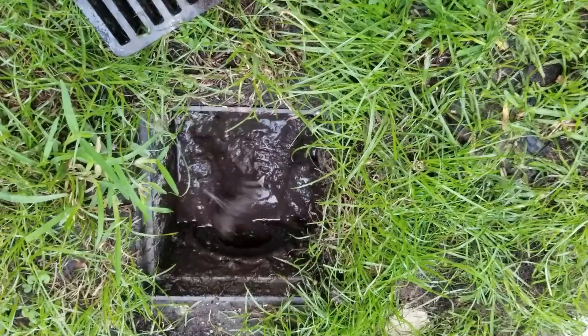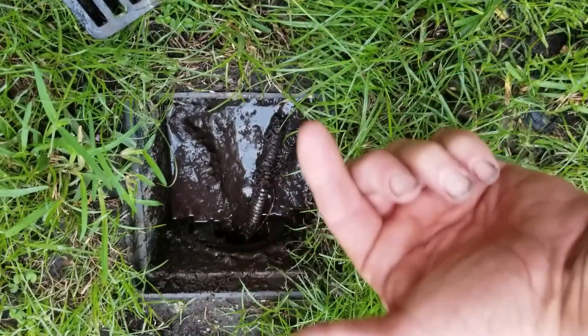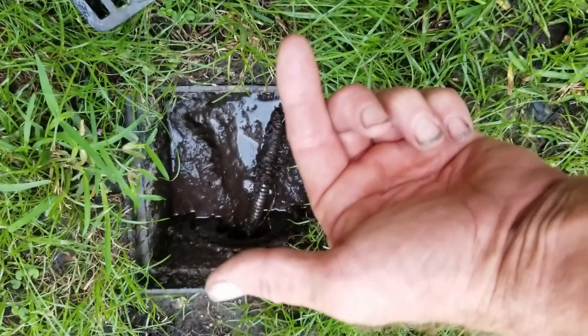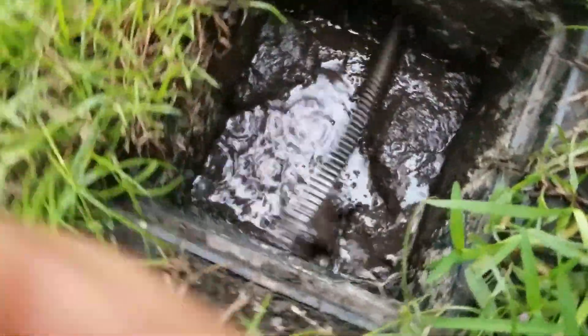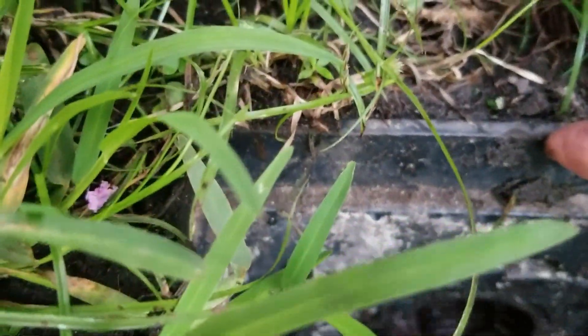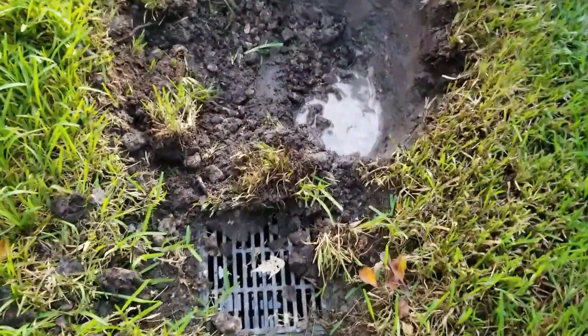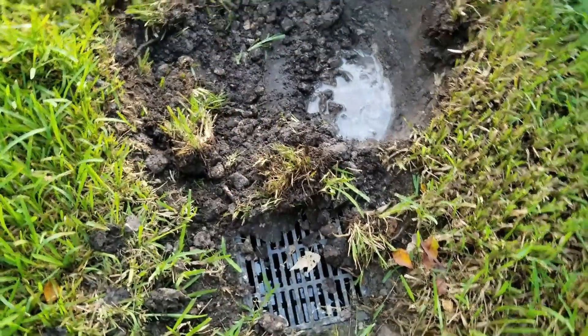You can see our cable that's come through the line. Now I'm going to help it go through the other side of the catch basin to the next catch basin, and then once we get all the way through, we'll hook up our discharge pipe, tape it onto that cable, and pull it back through. I pushed the cable through to the other side — the cable's now going to the inlet side of this pipe, and it's tight, really tight right here. We need to get that cable to go all the way back to this catch basin right here, and then we'll be able to put our sump pit in and attach that to this line and send that water all the way out.